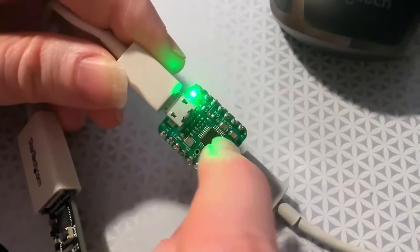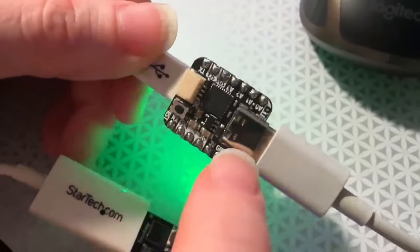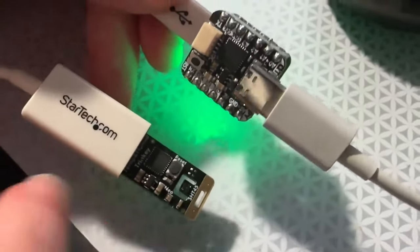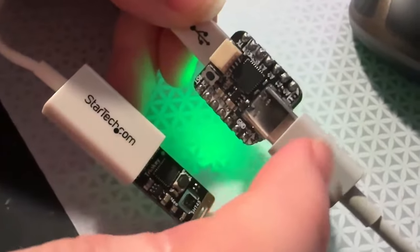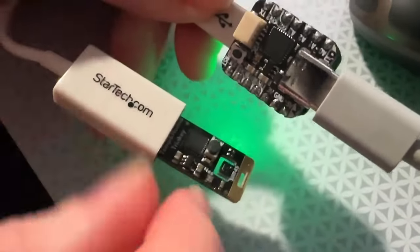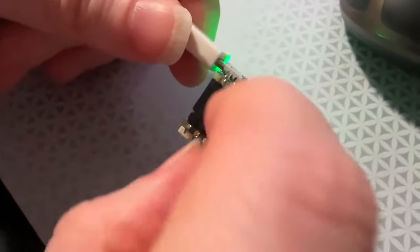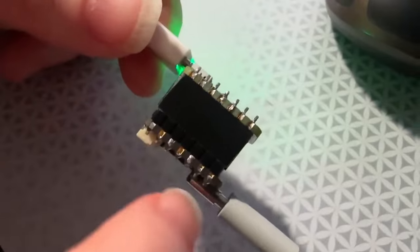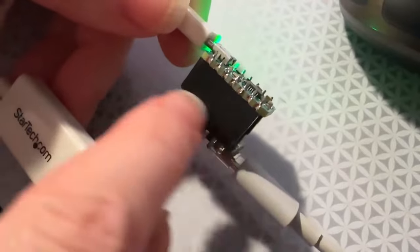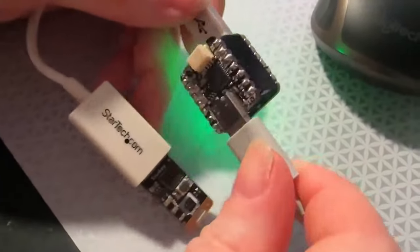This is a USB host chip that does SPI to USB host — it's called the MAX3421E — and it allows something with only one USB port to have a second USB port. It reads serial data and pipes it back out over USB, testing enumeration and CDC device detection, with a little LED indicating data transmission. This could be a great little board for accessibility projects or keyboard mods — you can do USB host-to-device translation.